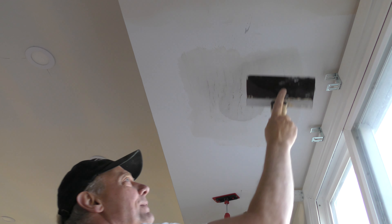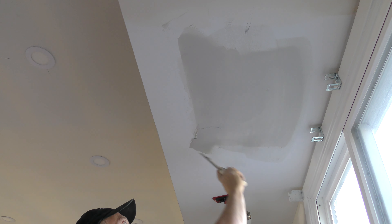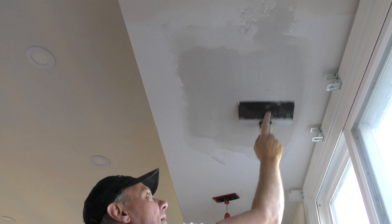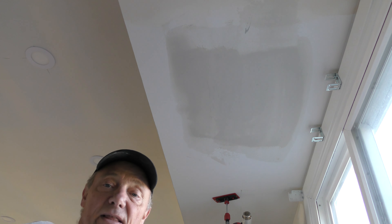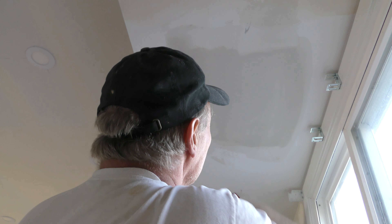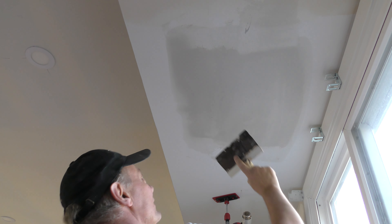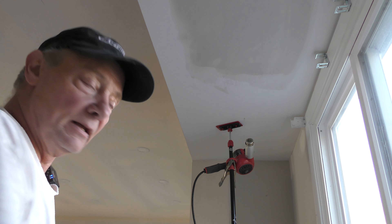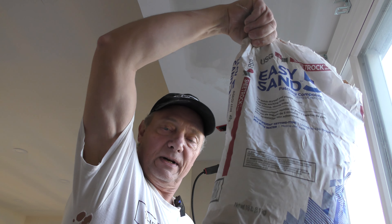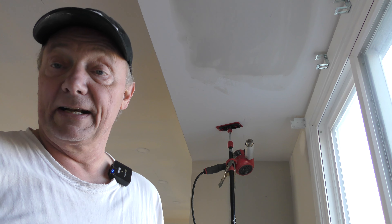Now I can put my second coat on here. I'll put it on real quick. That's it for now, and I'm going to do a third coat only because I want this slicker than snot — there's a lot of light coming in here. I also see a little wah-ha I need to sand out. I'm going to turn the heat gun back on and let this set up. This is Easy Sand 5 — it's supposed to get hard in five minutes, but it'll be quicker since I've got the heat gun going and it was warm when I applied it.